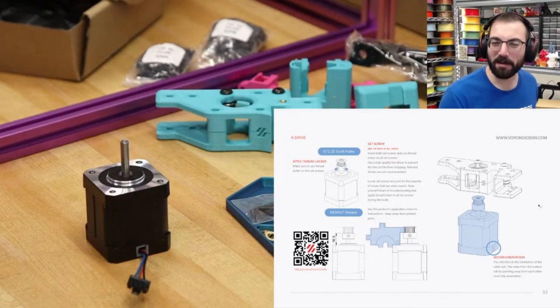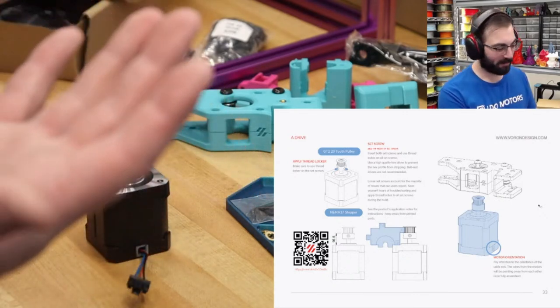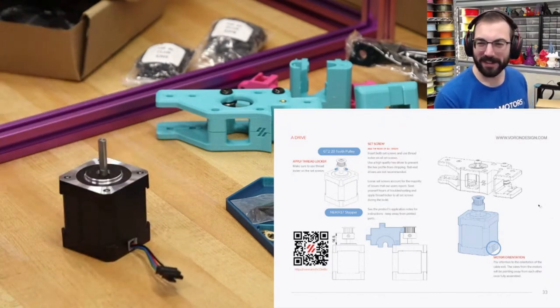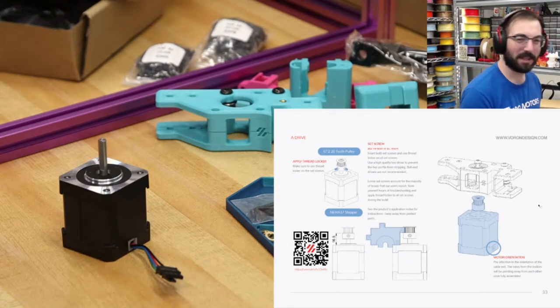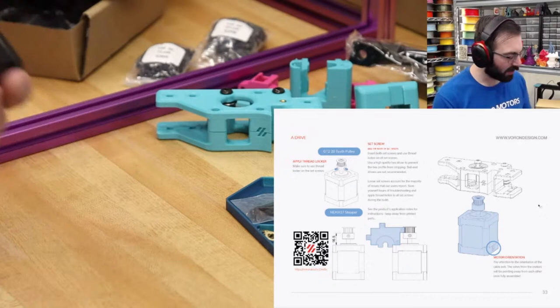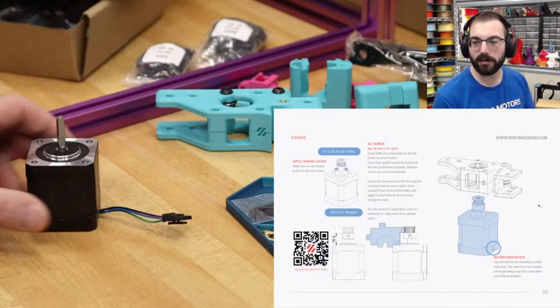They're high temp. How are you able to hold them with your bare hands? My hands are industrialized. They're used to high temp environments, apparently. If you treat an LDO kit the way you've been skipping steps, it'd be a lot of bad tracking. Yeah, right? It's not like Lego where you have to go step by step, but there's different sections that you have to do. Is that just a Microfit 3? Yep, they just crimped on a Microfit connector, which is perfect for these.